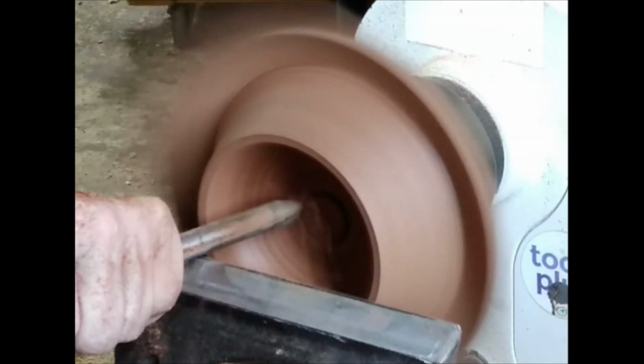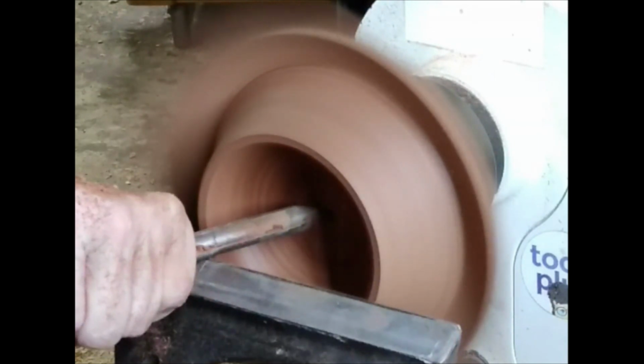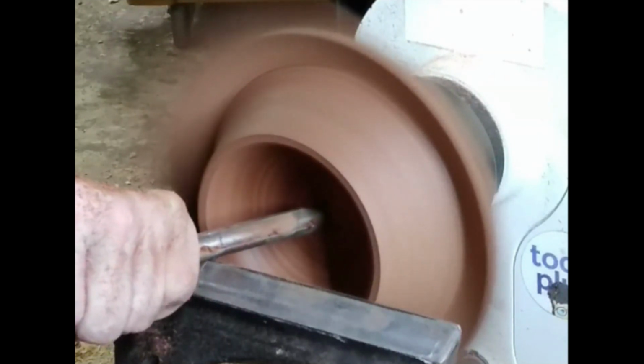By watching the video here, I need to back cut the bevel on my 5/8 bowl gouge if I'm going to do any small bowls like this. It really burnishes it real bad.